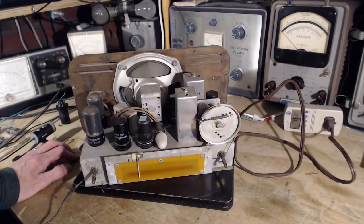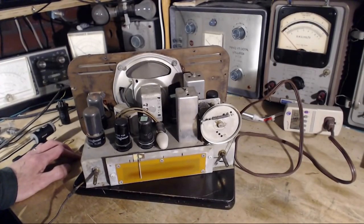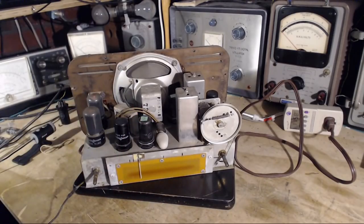Surprising thing is it won't pick up 640. 640 is slightly weaker, but yet it doesn't show up at all. Well, that's kind of interesting. But basically, I don't think the radio's performance changed with the two tubes switched, which says something, I guess. And listen to that hum. So we've got to track down what that hum is. I've got to get rid of that crazy hum. That's what's in store in the next video. So thanks a lot for watching, and we'll give this guy another day in here anyway.